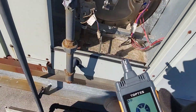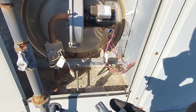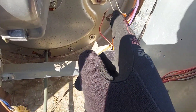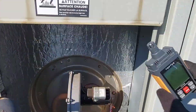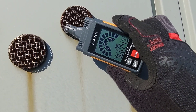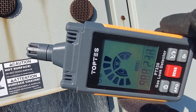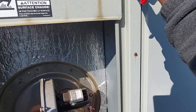Now I want to disable the glow igniter to sense natural gas directly through the exhaust. The furnace is currently off and the igniter is disconnected. The gas valve just opened — let's see if I can detect it. Yes — it's smelling really strong. The bar is rising. That's just natural gas triggering this device right now with no glow igniter. The gas valve is going to close once the furnace realizes there's no ignition.